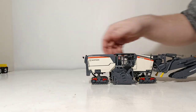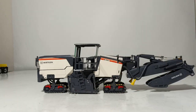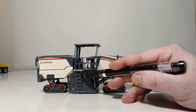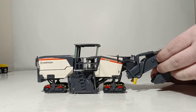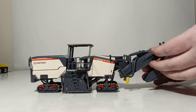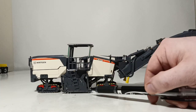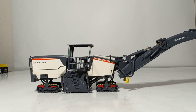We'll take it off the lowboy and get it ready to mill some asphalt. The first thing they would do is raise the canopy, which you can do just like that. The stairs here can be raised or lowered — you would lower them to access the Operator's Control Console, and when the machine is working you can raise them and put them out of service. Then you extend your discharge conveyor by pushing down on these cylinders and the conveyor folds out and locks into position. You can also raise and lower the height of the drum, but you can't raise and lower the height of the machine itself, which is a little disappointing — normally on Wirtgen cold planners that's been a feature.